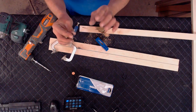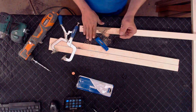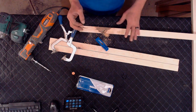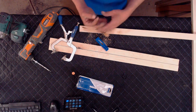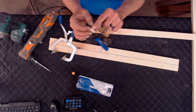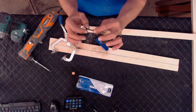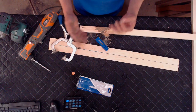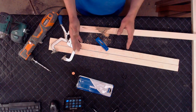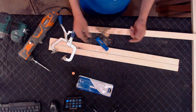You'll see two options, coarse and fine, and all these are inch and a quarter length for when you're doing three-quarter face frames. So fine is what you're going to want for all your harder woods, like maple, oak, all that stuff. If you're doing plywood or a really soft pine, they sell the coarse screw for the pine, the softer woods, and plywood. So when you're not too sure and the wood feels hard, use the fine tip, because these will split out very quickly and you have issues even trying to get it in there.